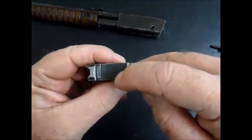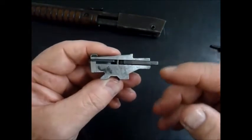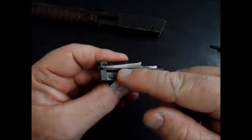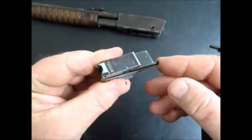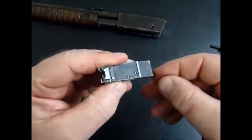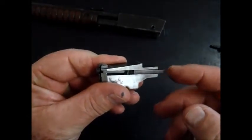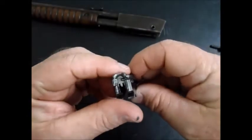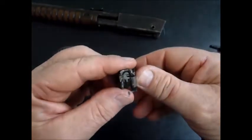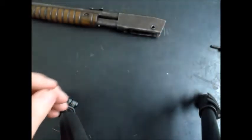The pins are actually fairly loose — you don't have to really drive them; it's only really the last bit that seats them. I put the first pin in to create the spring tension, then put the second one in, which limits how far forward and back the firing pin can go. As you can see, it now has spring tension. I think that should load all right.